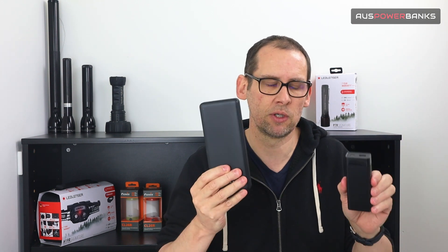If you're more stationary — setting up a base camp — with the panel in full sunlight all day, you can go with bigger power banks or multiple power banks. For example, a 20,000 milliamp power bank charging via standard USB in full sunlight would charge in roughly nine to ten hours, and that 20,000 milliamp unit would charge your phone probably six times or more. That gives you a rough guide — obviously everyone's usage is different — but hopefully that gives you an idea of what the panel can do and the storage capacity it can create over the course of the day.